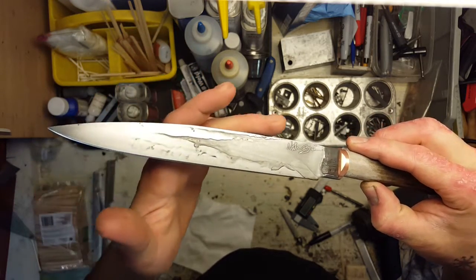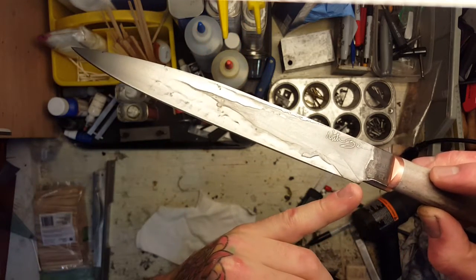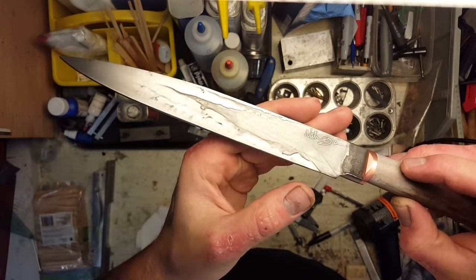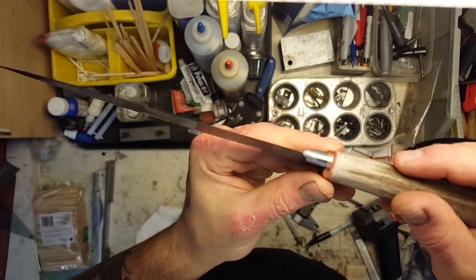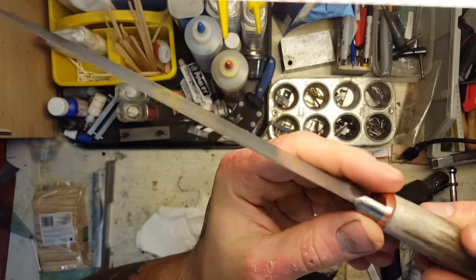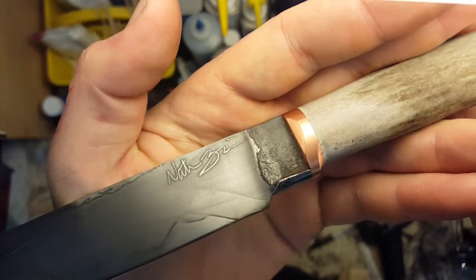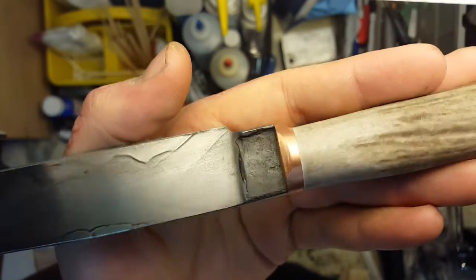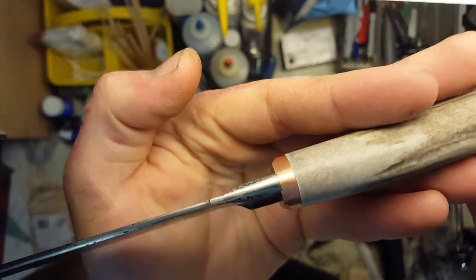You can see there is a differential heat treat on the blade and this one turned out really weird — it didn't get all the way back to the heel of the knife, but almost the whole cutting edge was hardened, so good enough for what it'll be used for. And I kind of did a little bit of a Brute de Forge kind of treatment with the ricasso here — I'll give you a close-up of that. I rounded that off while I was forging it, smushed it out a bit, and then matched it up with the copper perfectly in the front and in the back as well.